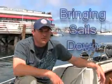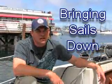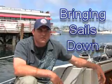Putting your sails down or furling your jib can be done while under sail. Typically, you're going to furl your jib first and release the jib sheet. Haul in on the furling line until the jib sheets reach the furled sail. It's easier to drop the main while under engine — turn your engine on first and motor into the wind. Alternate which side the mainsail falls between each sail slide. There's a lazy jack system which will keep just about all the mainsail on the boom, with about one sail tie along the back one third of the sail.